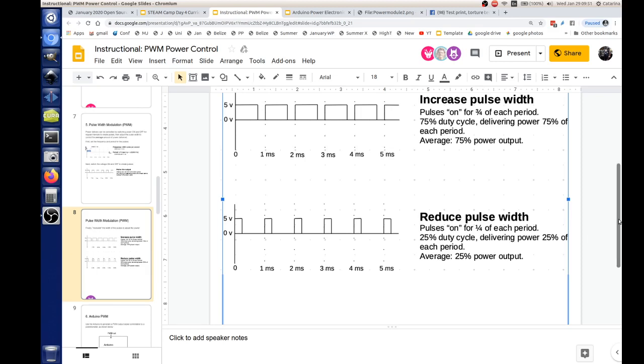One thing about the frequency: these reactive components, capacitors and coils, are frequency sensitive. If you use them correctly, you can use smaller, lighter components to get better filtering at higher frequencies. So the practical thing is, when you have a welder that's electronically controlled using this kind of method, you can have smaller components when you raise the frequency. They raise the frequencies to 100 kilohertz or so, 100,000 times per second that you're switching it on and off, to use small components.